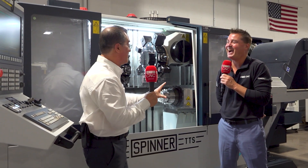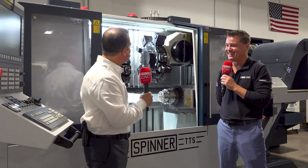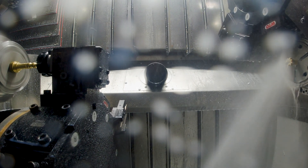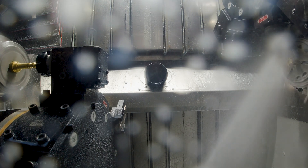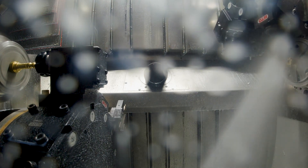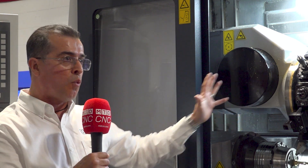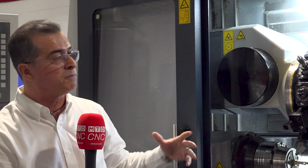I've seen bad sparks — we don't want that. Back to the question: the uniqueness of this machine is how it's built. As you can see, this is not a slant-bed lathe, multitasking lathe — it is vertically built. That allows for chip evacuation; you don't get chip problems with it. Our chip conveyor is wide — it's two feet wide. And also, the way the machine is built, you can have the three turrets working on one spindle or the other. They're not exclusive. The upper ones are not exclusive. Some other builders have one that can only work on the right and the other one can only work on the left. On this one, we can share turrets whenever needed to make it a lot more efficient.